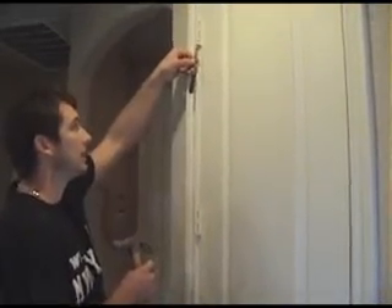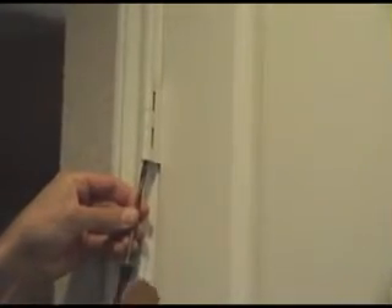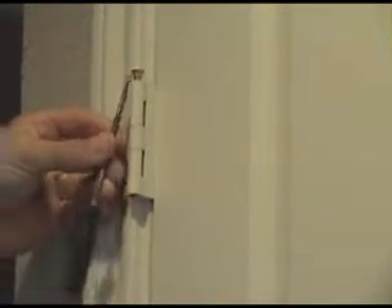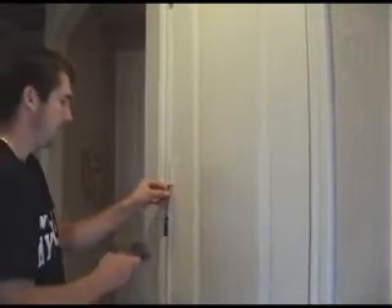The first thing you need to do is line the screwdriver up with the bottom of the hinge pin, put it on there and go ahead and hammer it — knock that pin loose until it comes out the top, then go ahead and pull it out. It's a lot easier to leave the door shut when you're pulling the pins; that way the door stays in place and you're not having to support it or putting pressure on the other hinges that haven't been pulled loose yet. Do that for each hinge and go ahead and pull that pin out.